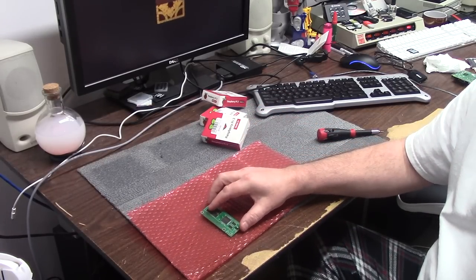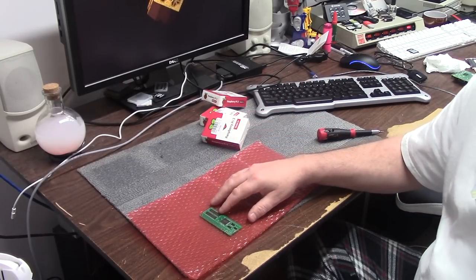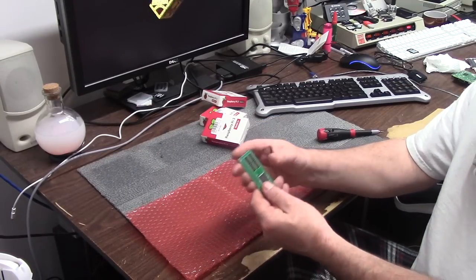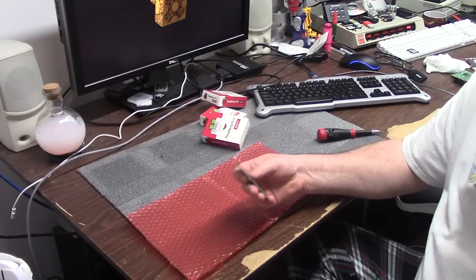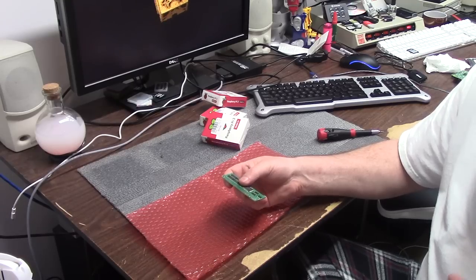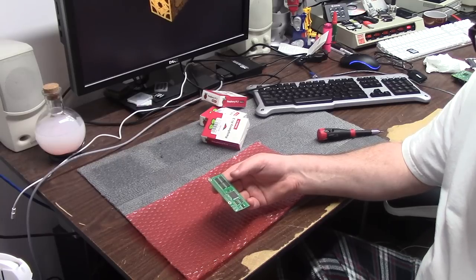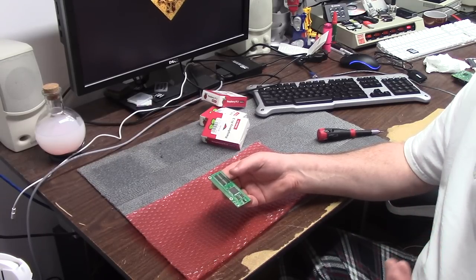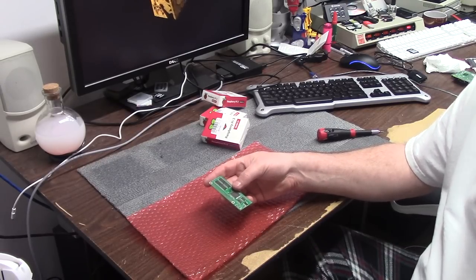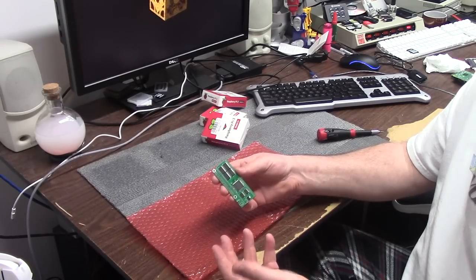So there's a website that I will link in the description below, which explains all of this probably 312.8 times better than I can. Basically, this will map Kickstart ROMs from 1.3 through 3.1. I don't know if they've tested 3.14 yet. It would prefer to use an Amiga 1200 3.1 Kickstart ROM because it has the best automatic boot config and stuff like that. You can also map RAM, Zorro 2, Zorro 3, or CPU RAM. It has a